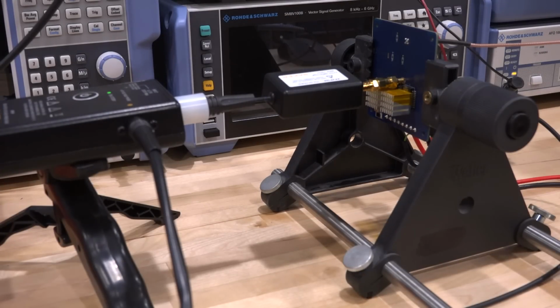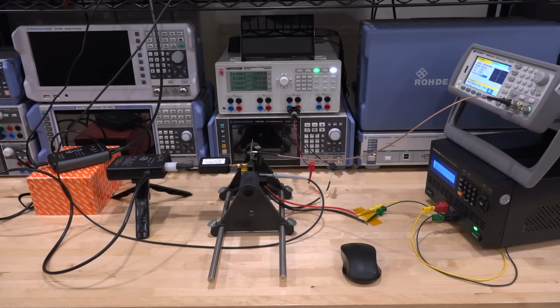And on the other side of the board, we do have a direct connection into the board itself, and that's the high side gate source voltage. So we should be able to ignore the entire common mode voltage and only measure the differential one. We do have a 10x attenuation, which then directly goes into the probe head. And here's our entire end-to-end setup.